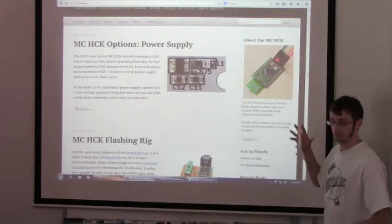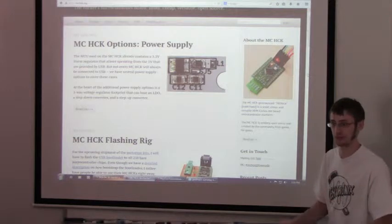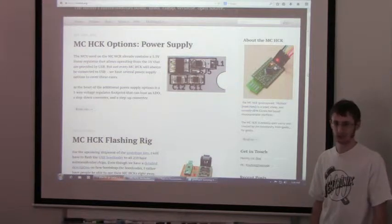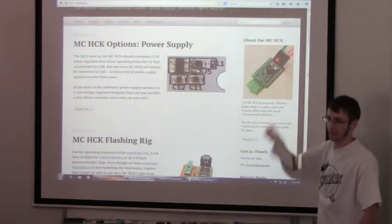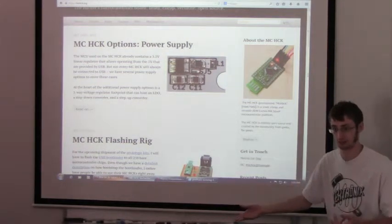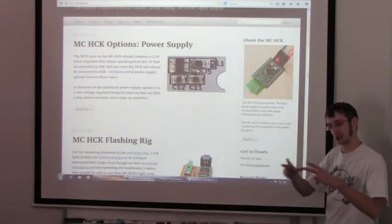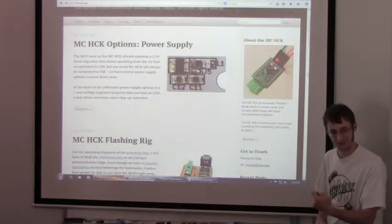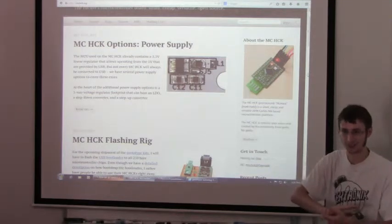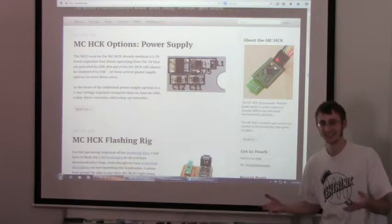It's pretty easy. The only big problem with these comparatively is the TCs — you have to flash the bootloader. The first time you get the chip, you don't have any. The initial flash we do when we first get the boards, we flash it the first time, we have a bootloader on it, and you just press a button and you can flash it as many times as you want. There are even plans to put a header on the initial PCBs, so if you really screw up — for example, if you flash a TMK firmware onto this, it'll overwrite the bootloader. So if you now brick your board, we put a header on it.